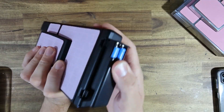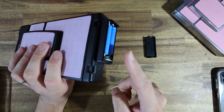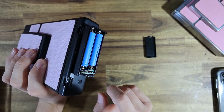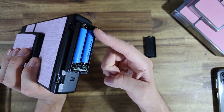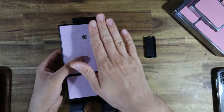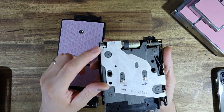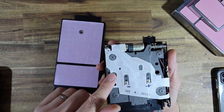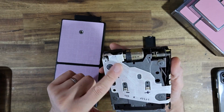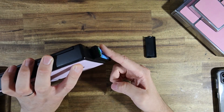What I've done, instead of having a little switch in the battery box, I've gutted that section and placed the buck converter there instead. I've hardwired the negative connection that comes from the battery into the hinge switch of the camera. So all the body ribbon cables that used to be inside the camera going to the hinge switch at the rear are completely severed — there's now no connection whatsoever. The hinge switch, instead of connecting to the body panels, now connects directly to the battery before it goes into the buck converter.